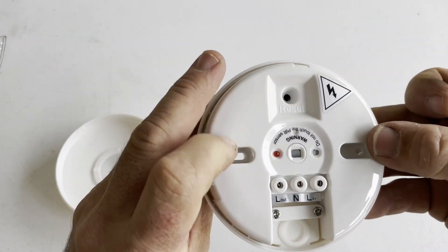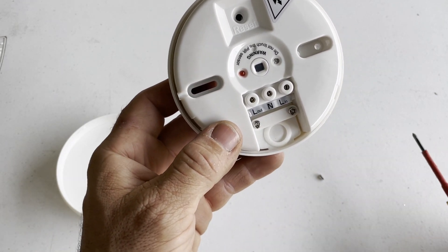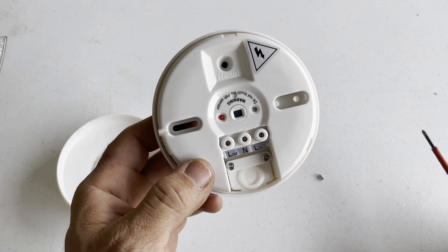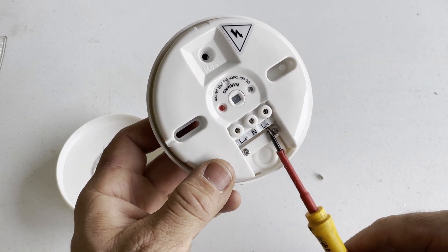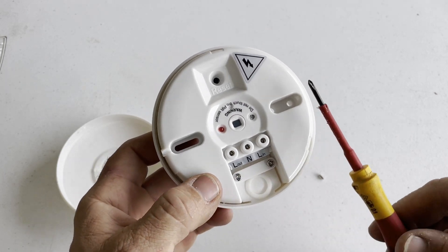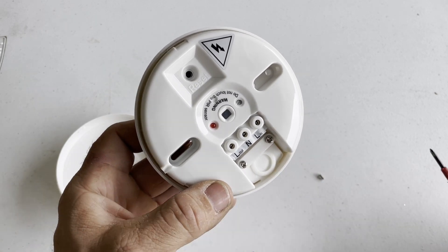With some sensors, they get wired up with a switch feed in and then a line out to the light. So that probably wouldn't work so well — you'd have to make the feed-in not switched so that it's just a constant active. That way the Wi-Fi is always connected and it works properly, and the output will still go to the light.